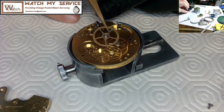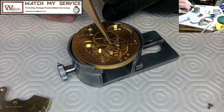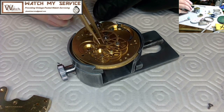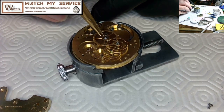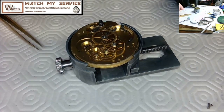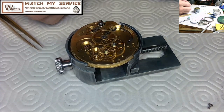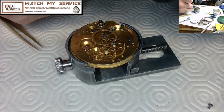The wheel configuration on this watch is fairly simple. Some full-plate watches from the 1860s and 1870s with non-standard pallet forks are very difficult to reassemble — a big pain. In those older cases I sometimes use rodico to hold the pallet fork in place. For this one I don't need that. I've elected to put the main plate on and install the pallet fork later — the mainspring has to be inside the watch before the plate goes on.